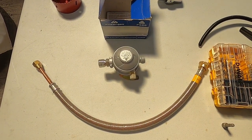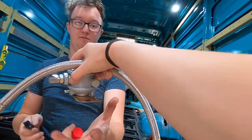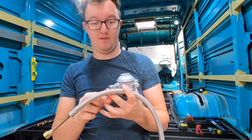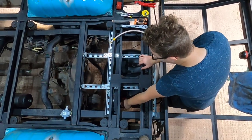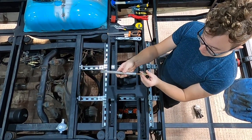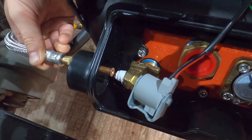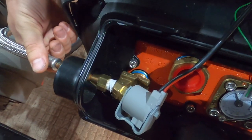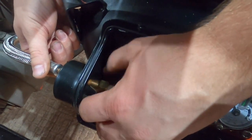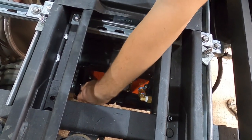The next bit we are fitting is the steel pigtail and the regulator. We have a solenoid valve rather than a tap on the output of our tank, which has a little cap on it at the minute. This steel pigtail is going to connect to that and screw on, and then the other end is going to connect to our regulator. The copper brass-colored bit fits right up onto the nipple, and then this screws over to hold it in place. We put a little bit too much tape on, so we'll try that again.